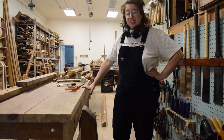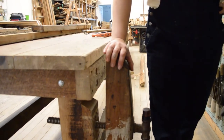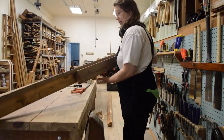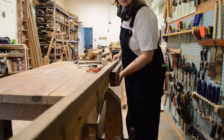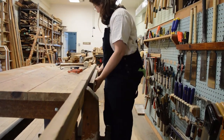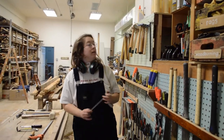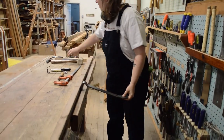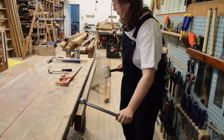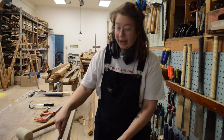There we go. If you've got a workbench at home or if you're here at our shop, a vice is a really great way to help you steady your wood while you pull nails and other things. I'm going to put this right in there because we need to separate all these different pieces. So we've got a little support over here, and we can take a Wonder Bar and use this with our mallet to start to pull apart and separate these pieces. If you find where the nails are, it's best to put the Wonder Bar right in between them.